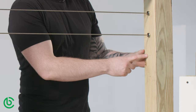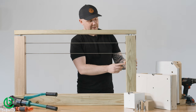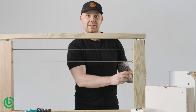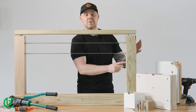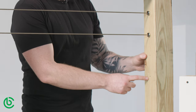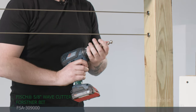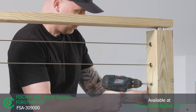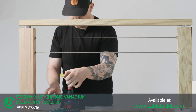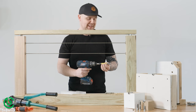You can see we have already marked the center point for our cables. These cables are 3 inches spaced, and the next step is we're going to take a 5/8-inch Forstner bit and just kiss the surface. That's not necessary, but it does really help minimize the likelihood of splintering, and we do recommend it, especially if your posts are already finished and you're worried about cracking and breaking apart that surface. After we've kissed the surface with our 5/8-inch bit, we're going to take a 9/16-inch brad point bit and drill our holes to one-and-a-half-inch depth. A quick way to gauge the right depth for your hole is to put a piece of painter's tape on your drill bit that marks that one and a half inches.